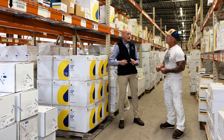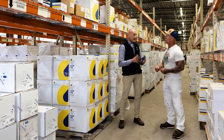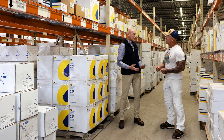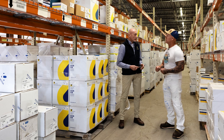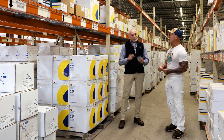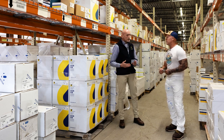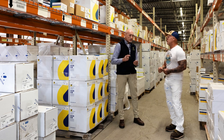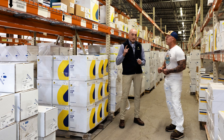When you're cutting things, you want to run cool because heat is the biggest detriment. Heat is the kryptonite to sandpaper — like kryptonite is to Superman. Once you heat it up, you start loosening the grains, and that's when you start getting shedding. That's when you start loading and a lot of things go wrong. My first advice to anyone about sanding is: don't use too much pressure.